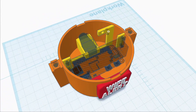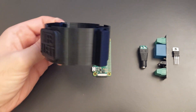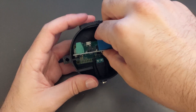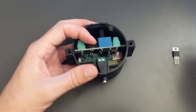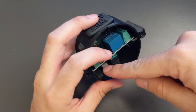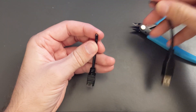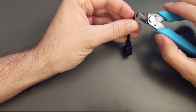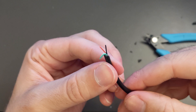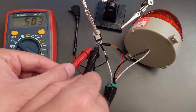The red light was an Amazon purchase, but the base needed to be 3D printed like the remote was. This also uses a Raspberry Pi Zero, although this one didn't have headers to save space since there was already a lot of stuff that needed to fit into the case, which I wanted to be as compact as possible. The Pi sits on the bottom; the big horizontal thing at the top is a relay, which allows the Pi to turn on the big light — which requires 12V — by sending the 3.3V that the Pi can output to the relay, which basically acts like an electronically activated switch. The little pronged piece is a voltage regulator, and a 12V power supply sticks out the back to power everything. I cut a microUSB cable in half and exposed the power wires, which I attached to the 12V power supply with a little voltage regulator, which takes 12V and turns it into 5V and some heat.